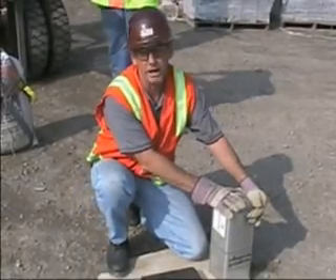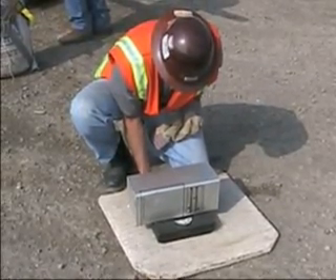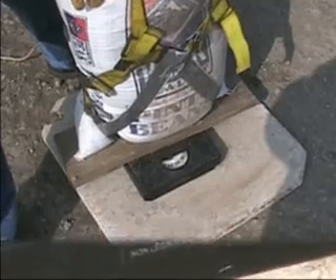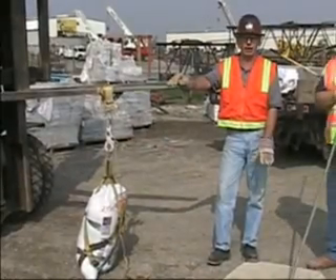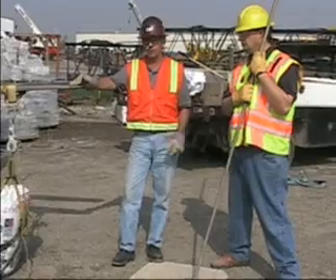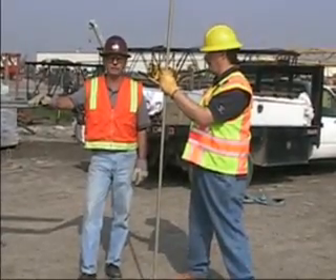We'll calibrate the bathroom scale here. I've got a known weight of 50 pounds of welding rod. We'll place the weight and adjust the scale so that I have an accurate 50-pound reading. I'm right at 50 pounds on the scale, and we will set the sandbag onto the scale to verify the weight. The weight is 206 pounds even. The board weighs 5 pounds, therefore the sandbag and the rigging weighs 201 pounds for our testing today. We'll go ahead and drop the bag directly onto a sheet of plywood just to show that the bag has enough strength so that it doesn't explode when dropped from the 10-foot elevation. After the initial control drop, we found that the bag split open. The standard says you've got to use a reinforced bag, so we'll double bag this with a second plastic bag — this should not noticeably affect the overall weight of the test.